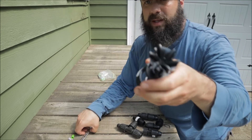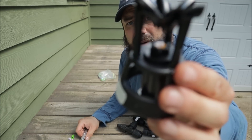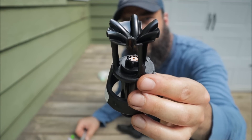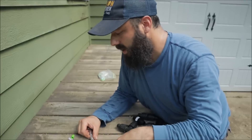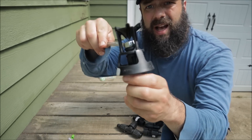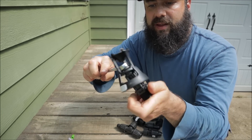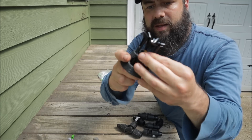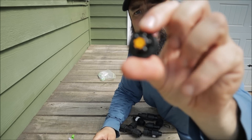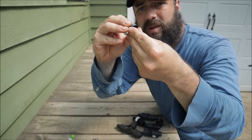They have the garden hose female fitting which attaches at the other side of the solenoids, and the ones I use at the bottom of the tees — this is three-quarter inch male thread to the quick fitting. They also make full tees and all that stuff. Another thing about the wobblers: if you need to take out the nozzle — like if it gets clogged, it's a pretty small opening — sometimes if you have anything in the line it might get clogged, or if you want to change out the nozzles, you can do that. This is a 5/8 inch wrench; I use the closed part to just crack it open. Don't over-tighten this or you can break it — it's just all plastic — and then this guy unscrews and comes out.